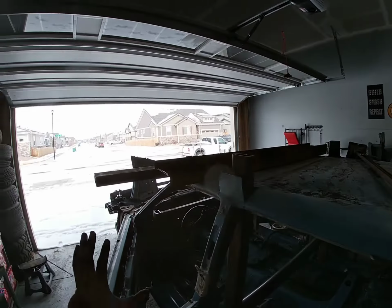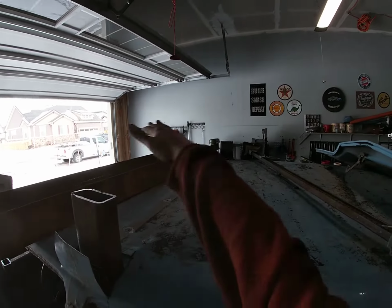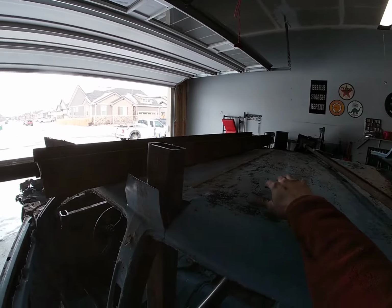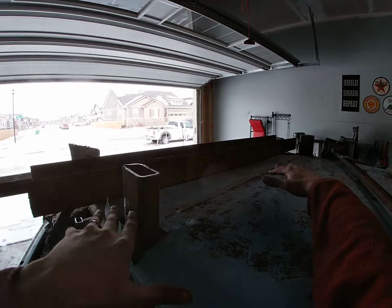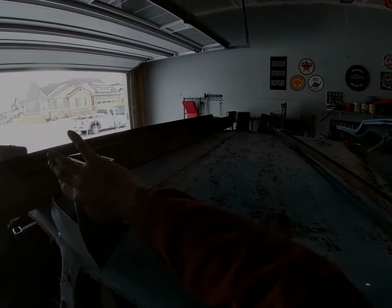So now we've got all this welded solid. We can take this H-beam and we're gonna set it on top of these 2 vertical bars, and then I'm gonna mark it from underneath, and then I'm gonna cut square holes so that we can actually lower this completely onto the ceiling and over these.